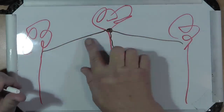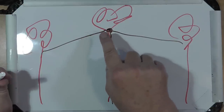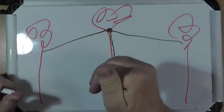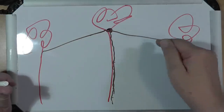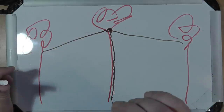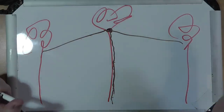Now, if you are going to do this, I would suggest insulated wire. Because if the wire rubs into a branch, it's going to hit the sap layer, which is wet and conductive, and can cause a problem with your signal. A lot of antennas like the reference antenna are made from uninsulated wire, so you might want to make your own antenna.